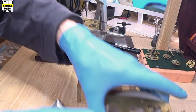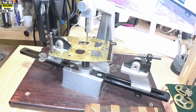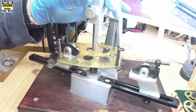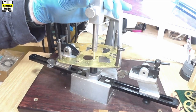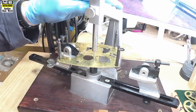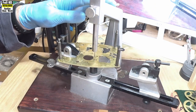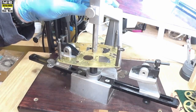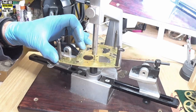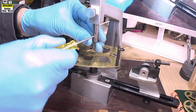So we're ready to start. Pressing down gently on the top of the reamer, we start turning the handle slowly — not too much pressure. Every so often you let the reamer up and wipe the swarf off it. Put it down again — you can feel it starting to bite a bit deeper now. It won't be long before that goes through. And there it goes. That's a 2.47mm hole we've now drilled in that.